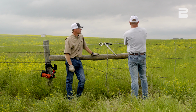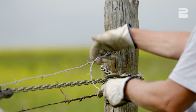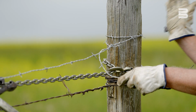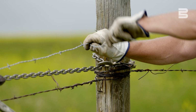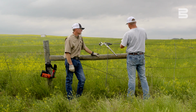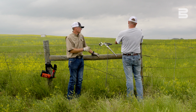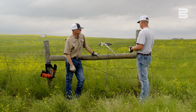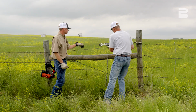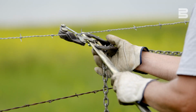Right. So, a lot of wind out here in Wyoming. So what I've done is the double wrap system seems to work out here really good. A lot of vibration in this fence. Double wrap, lazy tie, and should be here for quite some time. When I look at this fence and think how long it might have been here. Absolutely. Especially with this Bezinal coating. The longest lasting coating available in fences. So I've got it. I'll just drop this slack back in. Those posts want to creak a little, Van, when you put that kind of tension on them.